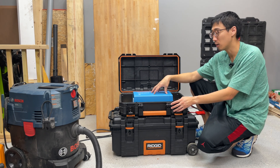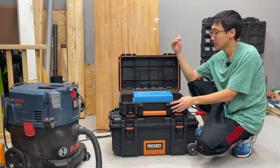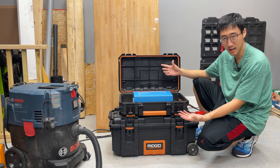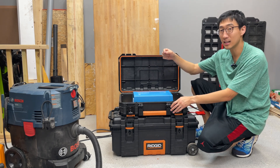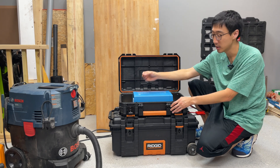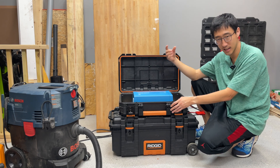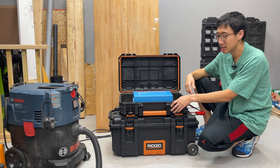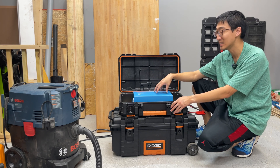The benefit of being on the 48 volt platform is that you're going to find a lot of common 48 volt batteries. Because it's 48 volts and not 12 or 24 volts, you can get pretty much the same amount of power using thinner cables, so you don't have to worry about thick cable, you don't draw as much current, and you're not losing as much due to heat, resistance, and ohms.